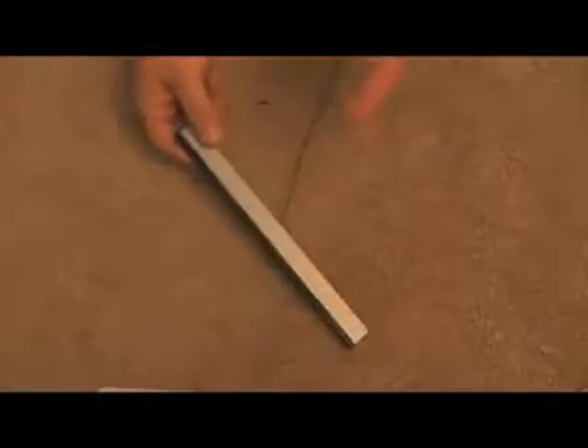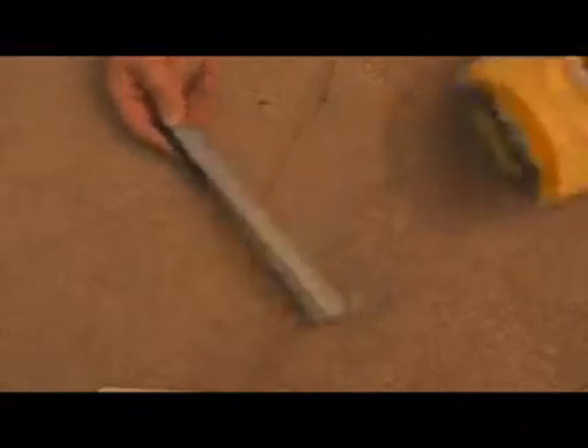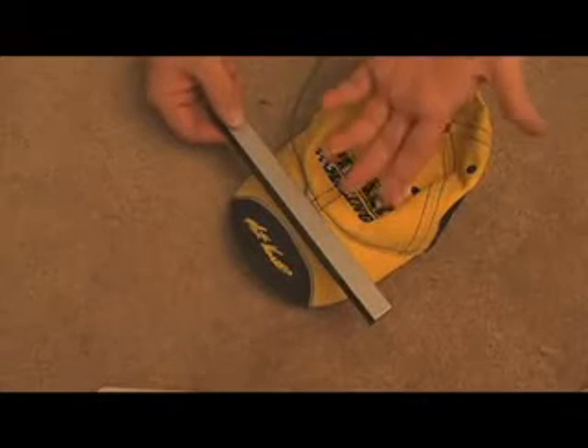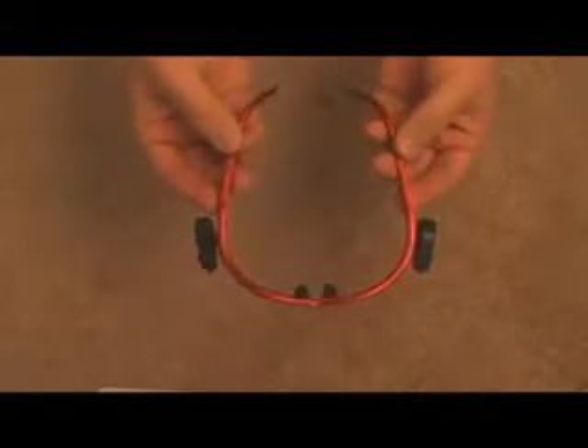The tricky part is we're going to have to find some way to mount the sensor bar onto our head. One common trick is to get a baseball cap and then mount the hardware to the cap, and this is definitely going to work, but it's a little bit goofy. So instead, some hardware stores sell these safety glasses with LEDs built in on the side, meant to be used as headlamps. Now if you replace the LEDs with infrared ones, you essentially get your head-mounted sensor bar in a nice sporty safety goggle form factor.